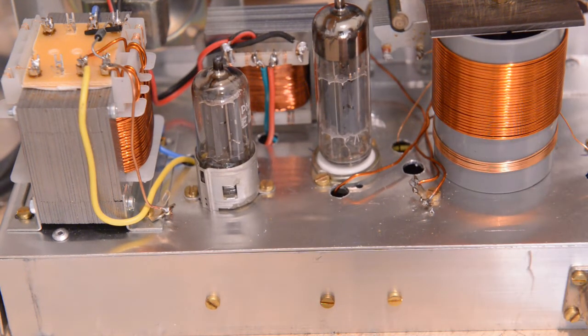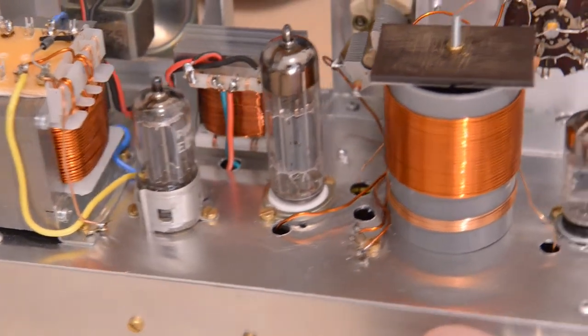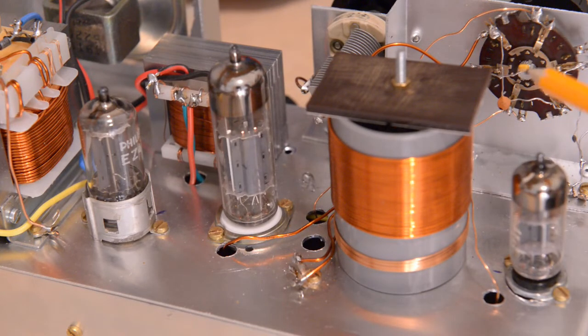So that was it, lads. And I had to make some adjustments on our capacitors here. This one is a bigger one. I think it is 33 picofarads instead of 22. So I took another one. I took it away from here, so that our tuning will be in line with what we wanted to achieve. So it was quite easy. It wasn't difficult. So that, guys, I will show you the schematic next, and that is the permanent schematic.